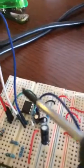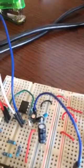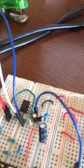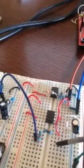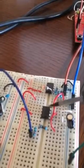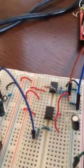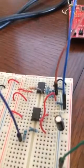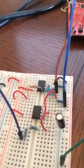That voltage differential then goes into this differencing op amp that also serves as a filter. So any excess noise gets filtered out, and then the signal gets amplified. The gain is approximately 1,000. Jumping across this blue wire, we go into another low-pass filter, which eliminates more low-end noise. That goes into a buffer, which makes sure that the signal isn't being changed past that low-pass filter. And then it goes into another differencing op amp to create the span of temperature that I want.